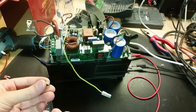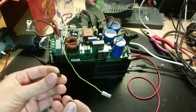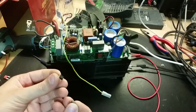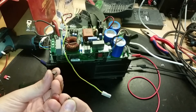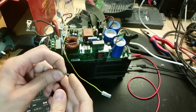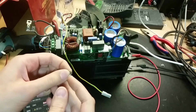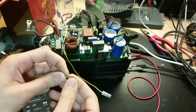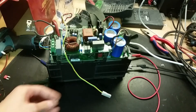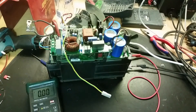I should search for more problems - I found these two. This is a MOSFET which was broken - it was shorted out. And this is a pretty special zener diode that didn't work as it's supposed to - it's a 47 volt, 2 watt zener diode. That's a pretty special one. Let's plug it in now and see what it does.